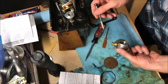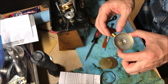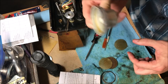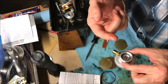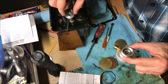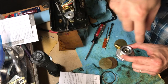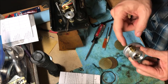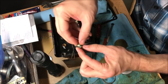I pulled that out without damaging it, because I'm not sure that piece gets replaced — it looks nice and in good shape. It looks like there's a one-way ball valve in there; you can hear that. So it sucks fluids up in here, and here's the plunger — when this pulls up it sucks fluid up into a reservoir, then it pushes back down, the ball plugs the hole, and it forces the oil out through this little tube.